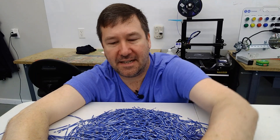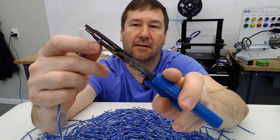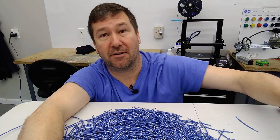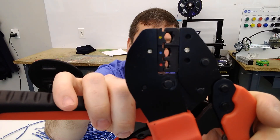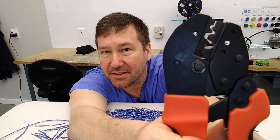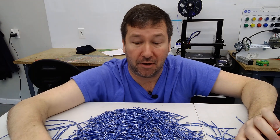Where I see a lot of problems is with uninsulated ferrules. I'll cut my wire and strip another bit — there is a completely different crimper for these. On the insulated crimper it's fairly symmetrical and comes in evenly, but on this uninsulated one it actually puts a divot on one side of the connector. The question is: which side of the connector should that divot go on?